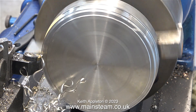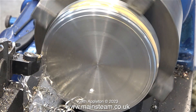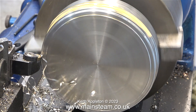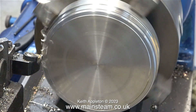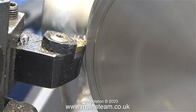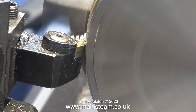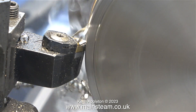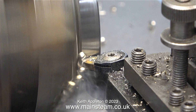I have a long way to go before I start to machine this recess because the piece of metal I bought is purposely much larger than I need, in order to make some videos about how to do it and how not to do it. An immediate warning: do not handle this swarf with your fingers. As you can see, I'm moving it out of the way with a pair of grips. Some carbide tips are designed to break up the swarf into smaller pieces, but this one doesn't seem to be doing that — the swarf is coming off in more or less one continuous length.